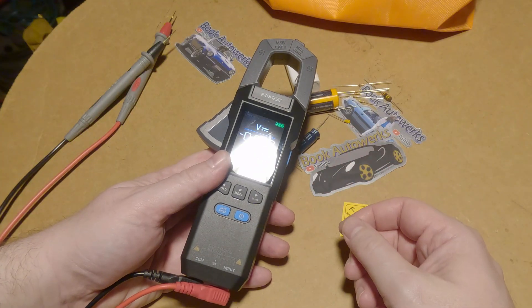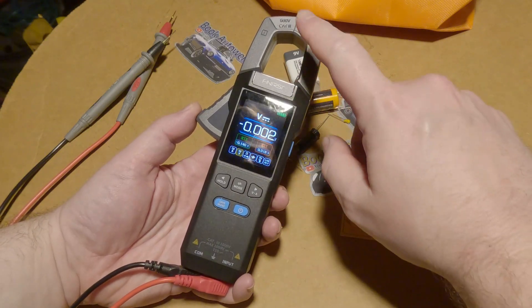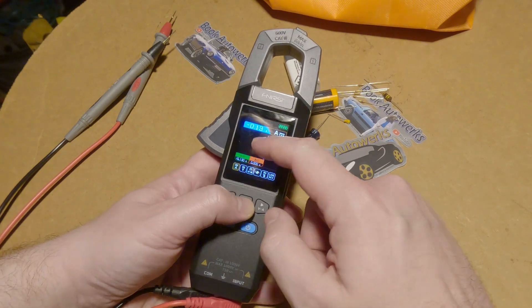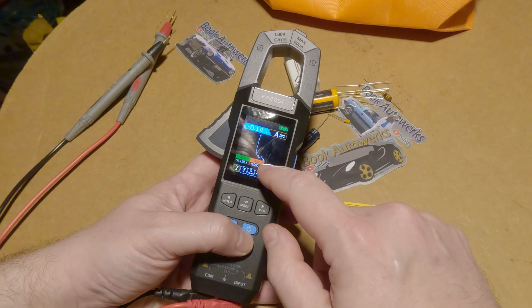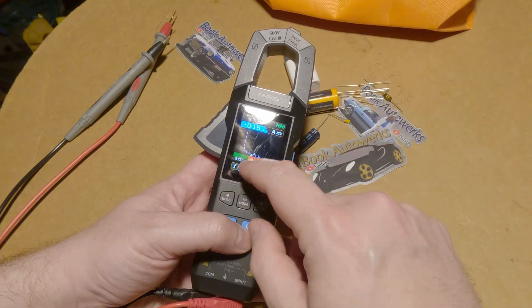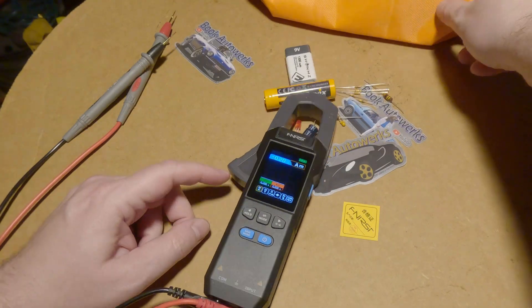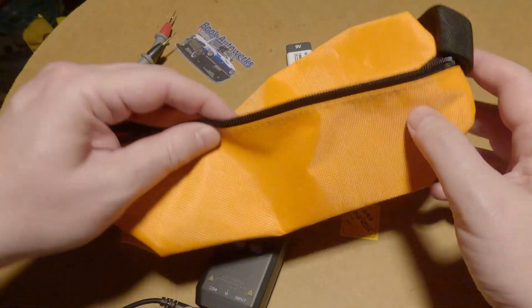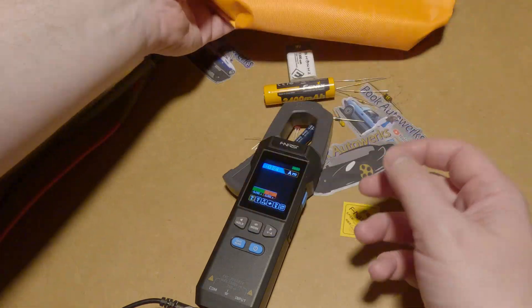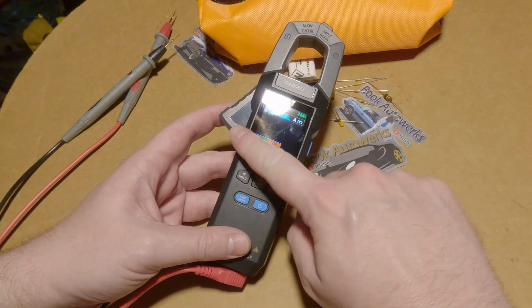Overall I'm actually really impressed with this thing. I think this is going to be my go-to meter for carrying around and testing things. Most of the stuff I do is DC, and being able to have a DC clamp meter is fantastic. I absolutely love this little waveform scale — for automotive stuff you could do a cranking test, hook it up to a circuit with a parasitic draw, and as you remove fuses you can see the amperage drop. It didn't come with a case, so I'm stuffing everything into a pencil case, but this meter is really compact. There'll be a link in the description below — I highly recommend it.